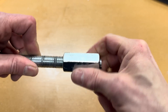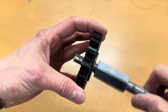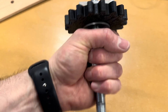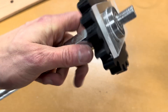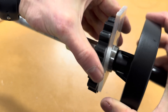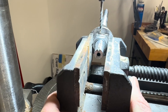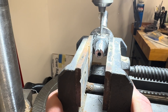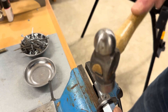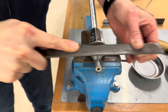Right now I'm working on permanently installing those hat-shaped nuts onto the threaded rod, which is why I'm setting this all up like it's going to be when it's permanently installed on the vise. The big coupler nut isn't actually part of the vise face — it's just being used as a jam nut. That little piece of plexiglass and the bearing are just being used right now to get correct spacing. This is all about making sure that the hat-shaped nut is in the correct place on the threaded rod. I used the big jam nut to make sure it doesn't move so when I take this apart I'm able to drill a hole in the right spot to put a pin in. I just used a big nail to lock that nut into place, cut and filed flush so I could still slip the drive gear over the nut smoothly.